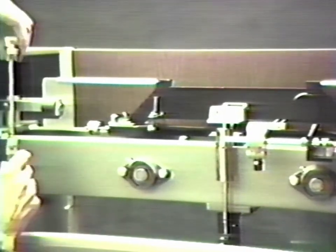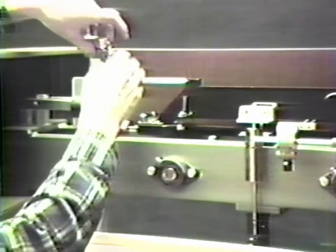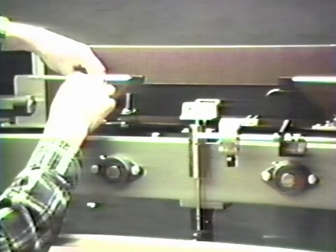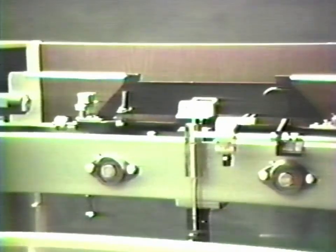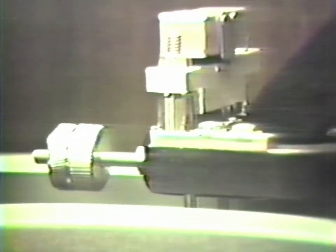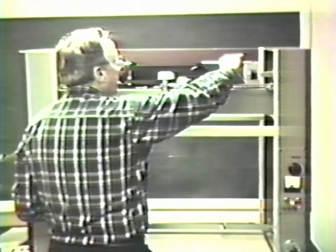Hold the left stirrup marked with one dot with the hook facing forward and thread it over the left knife edge, avoiding contact with the edge. Then lower it into place with the support points in the sockets. Assemble the right stirrup in the same way.